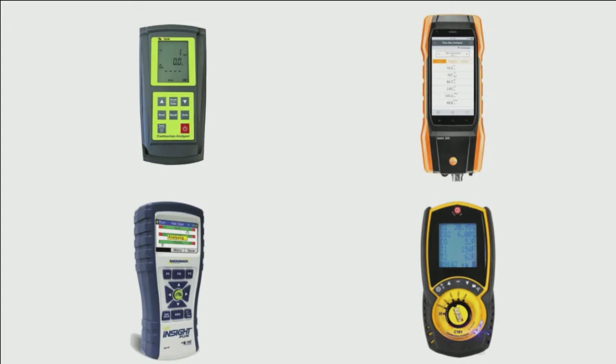And what I mean by that is it has a strong pump on it, because you want to be able to see quick changes in the flue gases. It's kind of like having a fast reacting thermometer. You want to make sure that you can see the changes quickly, not a 10 second delay. Right, because that would make a huge difference whenever you're trying to make measurements.